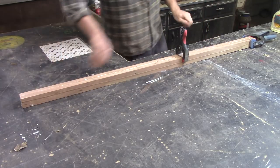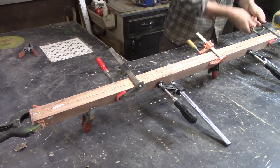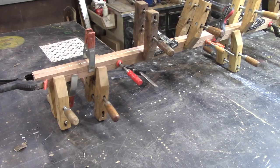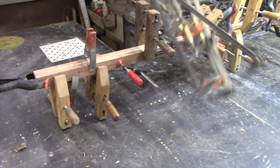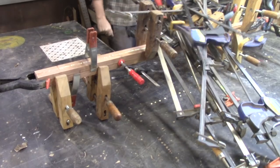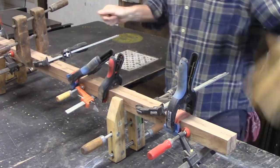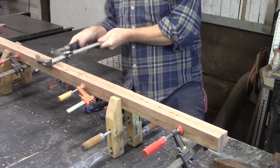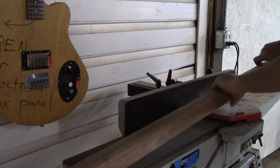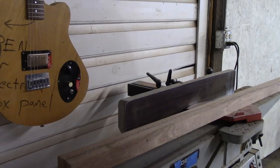In order to get my inch and a half thickness diameter, I had to laminate two pieces of this wood together, and so I clamped it up using quite a few clamps to avoid any gaps since I was going to be cutting these into smaller pieces. I made sure I used every clamp that I had. The next morning I pulled the clamps off and did a few passes on the jointer and through the planer to just square it all up. I had cut it just a little bit big — about an inch and three-quarter to start — so I could bring it down to a perfect inch and a half square.